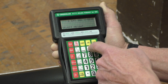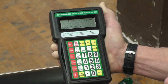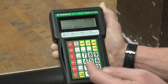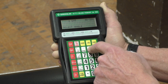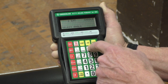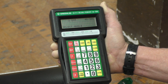Now there's a saddle. We're bending a 3-bend saddle. If you hit it a second time, it says 4-bend saddle, or you have 2 offsets that are in the same plane that are going for a 4-bend saddle. Or if you hit it a 3rd time, it'll go back to saddle. So either you got a 3-bend saddle or you got a 4-bend saddle. So know that these buttons, you can hit them more than once to get the different bends that you want.